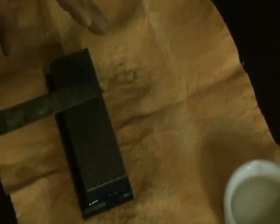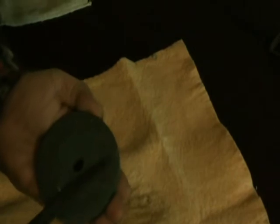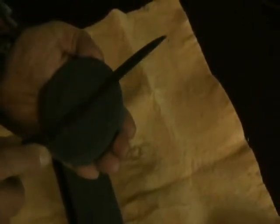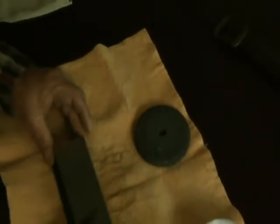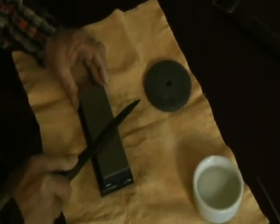Because this knife is so dull I'm using a medium grit. If I had a coarse grit I would probably use it. I could rough it in with something very much like this — this is a medium grinding wheel for a small bench grinder — and using a light angle and light strokes I can rough in the edge. It's roughly a 12 degree angle; that's a guess. I've been doing this a lot of years so you just get a feel for it after a while. Then you bring it to your stone.